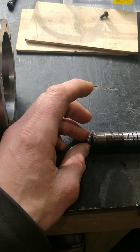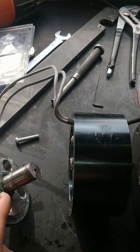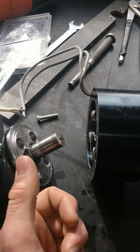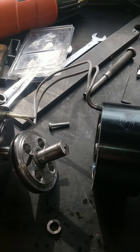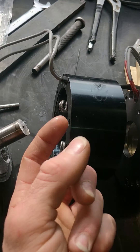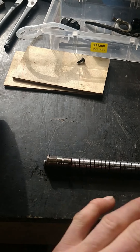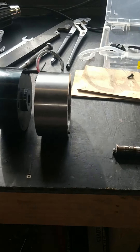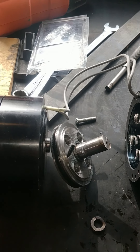That's where we got the spin weld, because it was spinning really fast. This second piston here pushes back the other way. That must be to ensure disengagement of the tool unclamping mechanism — it has extra spring loading and a piston pushing the other way to make sure it gets disengaged from the push rod before the spindle starts spinning again. If you push the wrong button and manually make it happen while it's spinning, you will damage your spindle. Yeah, that's what happened.